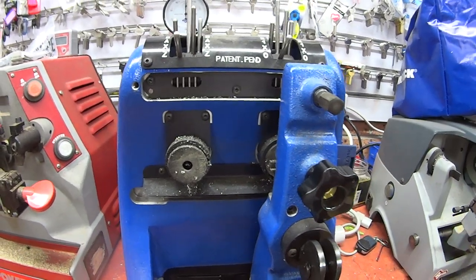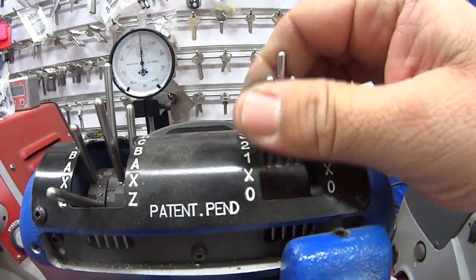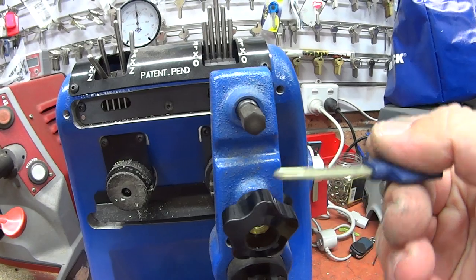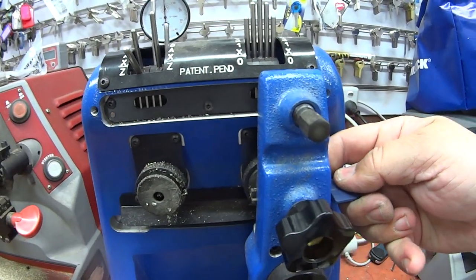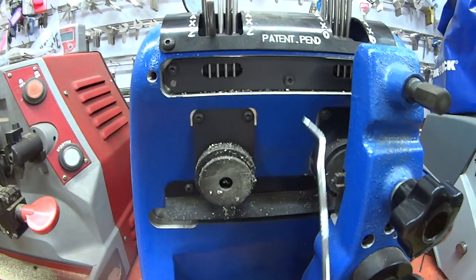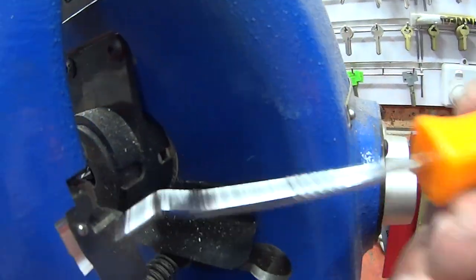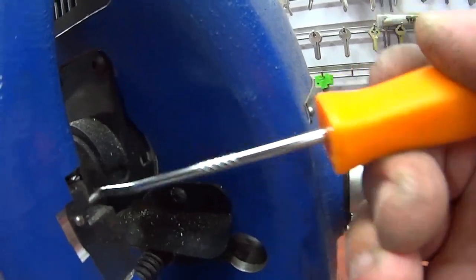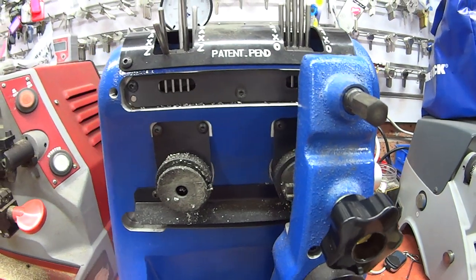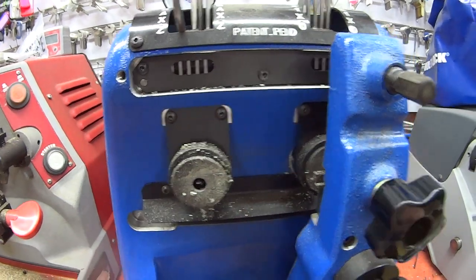If you have a key with side cuts, the little 'S' on the side symbolizes the side cut. If it has, say, five side cuts, I put them all to the S function, loosen my jaw, and put my key in sideways, pushing it all the way in. One thing I've noticed with this machine is you've got to keep it clean — I use a spike and you can see how much debris comes out. You do get crumbs in there, and if you do you won't get an accurate key, so cleaning the machine is critical.